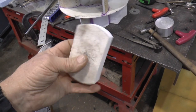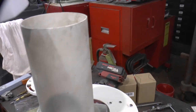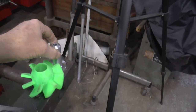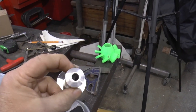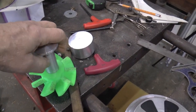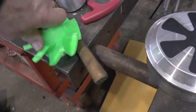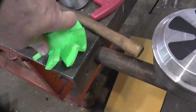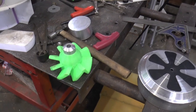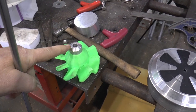That's not the final hole — that was just to machine this in it. It just fits right in there, just nice as pie. I turned this piece and that is going to go in here, like that. And then for a shaft I've got some drill rod. Now, this was all made at one setting in the lathe — never taken out — so it runs nice and true. And this is reamed for this piece of drill rod.